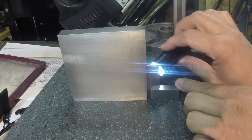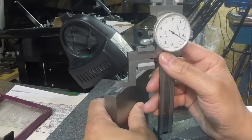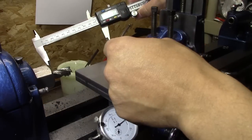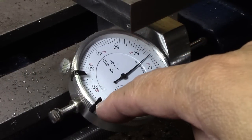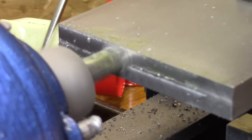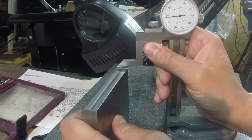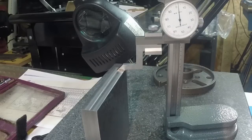I was really concerned about how square this was going to be, so once that one side got done and I saw that it was square, I was so excited. Now after measuring, I check with the print and see what I have to cut off. So I need 49/1000ths off of there, so I put a hash mark there at 49. Inch 8/1000th. 4 inches 2/1000.